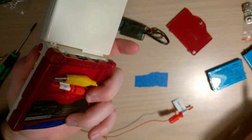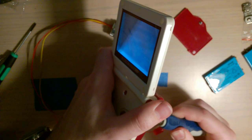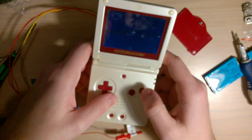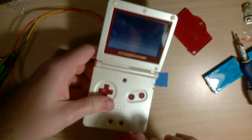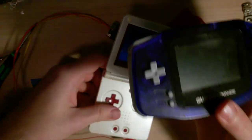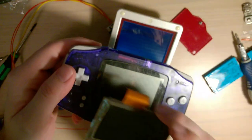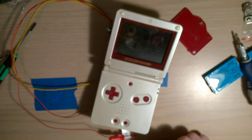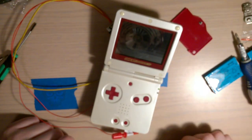That looks good to me. I had to turn it about a quarter turn clockwise — maybe a little bit more. Now you can cycle through the other test patterns, and quite frankly it doesn't look that different — it already looked pretty good. But that's how you adjust the LCD after you replace it. You have to do this any single time you switch LCDs. So if you have a Game Boy Advance console, it's not backlit or anything, you drop it and crack the screen, you pop a new one in — even OEM, non-backlit — you still have to adjust it, otherwise your color is going to be off or you'll see a little bit of flicker. This AGS aging ROM makes it much easier to do. Otherwise you just have to boot up a game and keep playing with it till it looks right to you. And that's all I got for today. Thanks for watching.